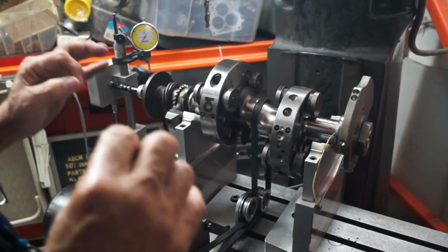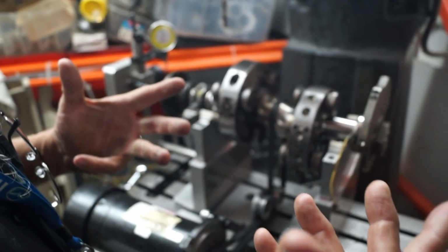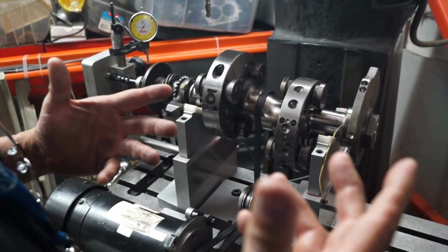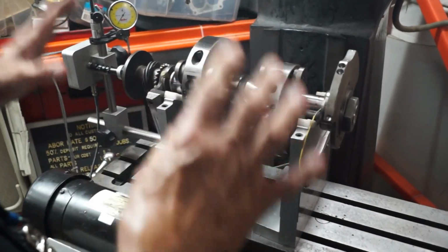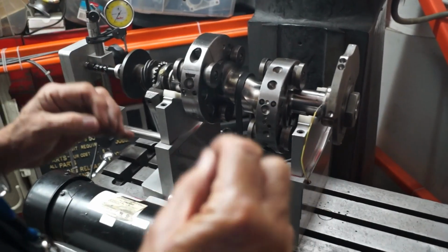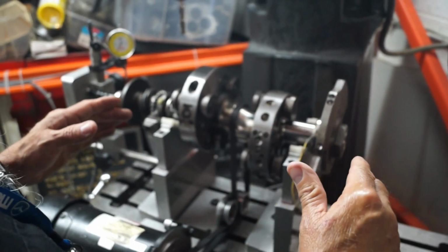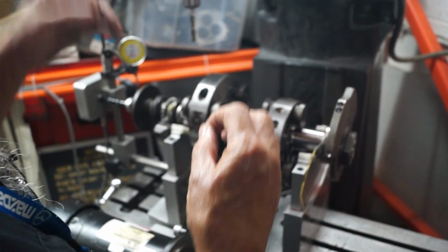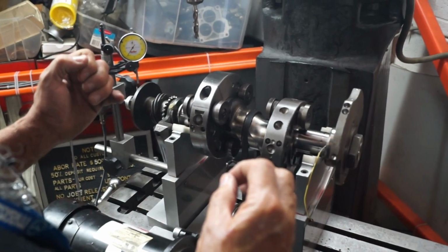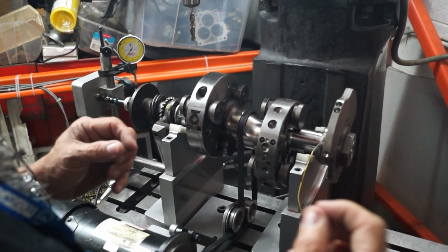But there's something that I want to point out. When you start getting to the minutest amounts of weight, and I'm talking like 1/10 of a gram. If you want to get to that level where I actually have this rotating assembly balanced to less than 1/10 of 1 gram, what you do is when you're reaching for that 0.00 something, you just can't trust that you're going to make a drilling operation, a weight removal operation, and not go too far, not go beyond the point.